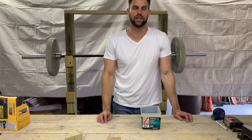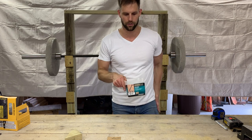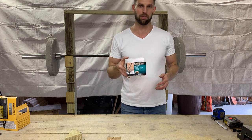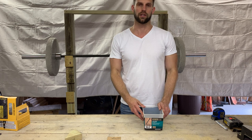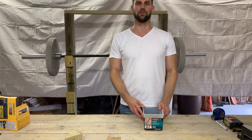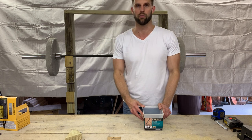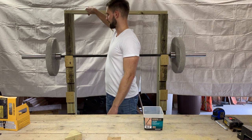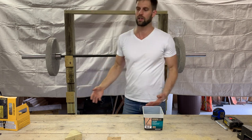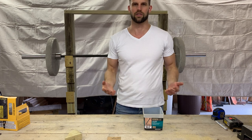We're done with this project. To reiterate: I do recommend using something like a Deck Plus brand screw for the j-cup holders — it's really important to make sure those fasteners are the strongest ones in the whole project. The other screws holding the struts and bottom struts together can be just any decent construction fastener.